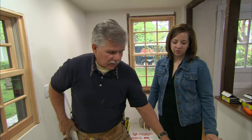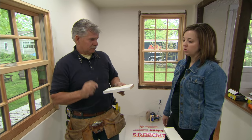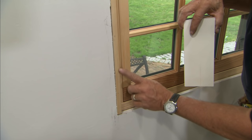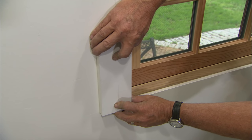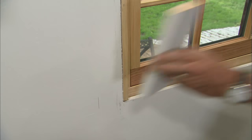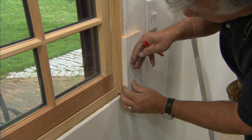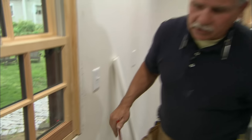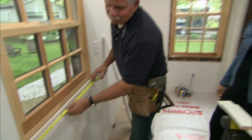We're going to use the same wood for all of it. To get started, I've actually cut a scrap piece of the one by four so I can get the length of my window stool. I'm going to position it right against this edge of the wood, which is called a stop. I hold it even on the edge and I mark the outside of it on the plaster wall. I take it down, hold it on the edge of the window stop, make sure it's flush, and mark the edge. Then I measure between these two marks and that will give me the length of my window stool.